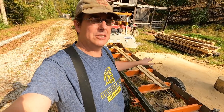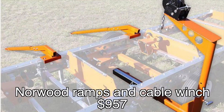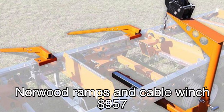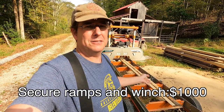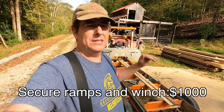If you don't want to engineer your own system, most of the sawmills you're buying have loading systems available. The Norwood system involves metal ramps with tabs that help keep the log from rolling back, plus an anchored winch on the side of the frame. You run the cable out around the log and bring it back to hook onto the chassis of the bed — as you crank, the tightening cable turns the log and rolls it up into place. That system purchased and shipped is about a grand, so it's a pretty big expense, but I'm going to put it into our cost list.